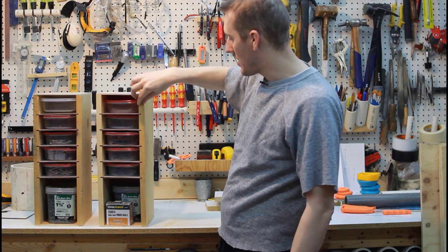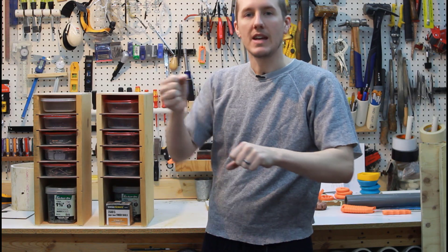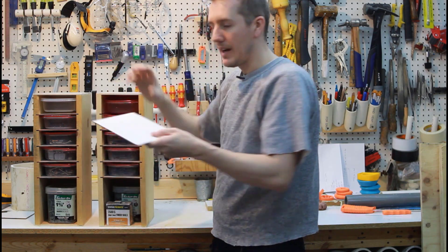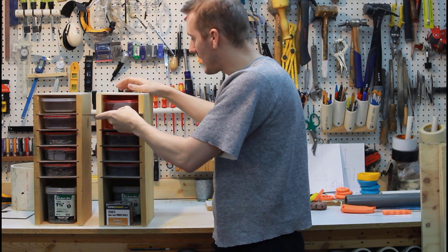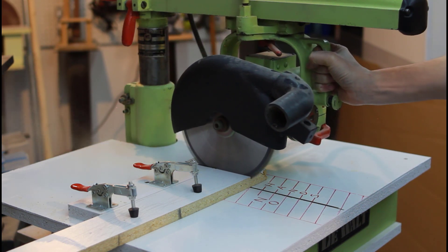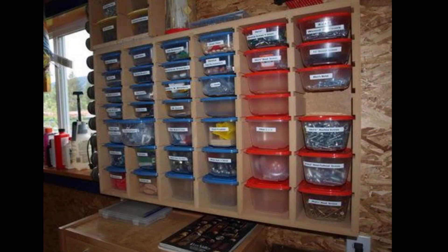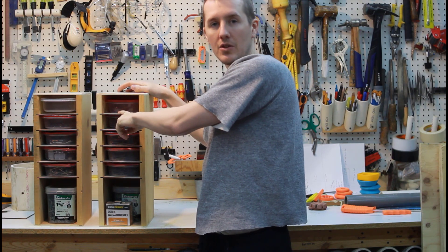To make the boxes I used thin plywood for the top and back, and hardwood — just some pine — for the sides. I cut the slots out on my radial arm saw, which I've been using a ton now just for cutting dados and rabbits to a certain depth. I cut thin hardboard sheets on the table saw and these just slide in, with the Tupperware containers sitting on top. I've seen where you can cut dados so the Tupperware edges ride in the grooves, but I didn't like that — they're pretty cheap and would probably break or crack — so I prefer having the little shelves to sit on.